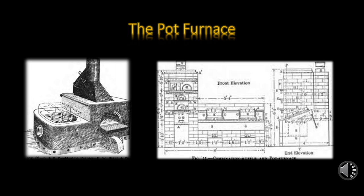Unlike the picture on the left, the pot furnaces were sometimes placed alongside of a muffle furnace. Each had their own ash pits and the coke was charged — that is, placed into the furnace from the top. At the bottom was usually a draft hole or some form of forced draft. The average pot furnace had a crucible cavity that was roughly 12 to 15 inches square with a depth to the coke bars of about 24 inches. These furnaces are no longer used today, except in rare instances. Without any forced draft, temperatures of about 1000 degrees centigrade could be reached, but with a forced draft, 1400 degrees centigrade was reached. These furnaces were generally made of refractory bricks, which were made to withstand such high temperatures.